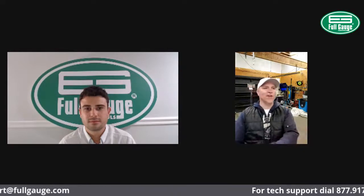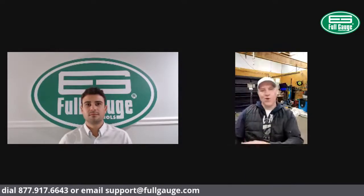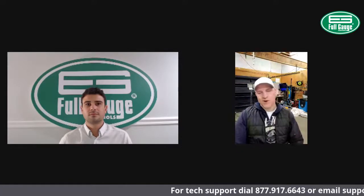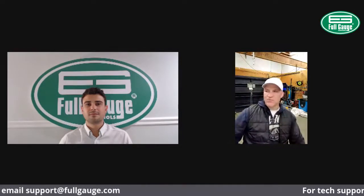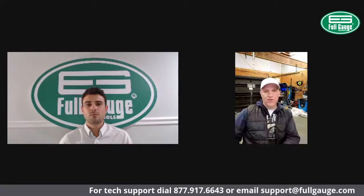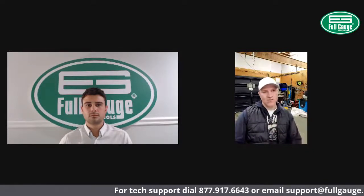The weirdest thing I think I've ever done with the Full Gauge controller is take one of those ventless heaters that use a pressure-based thermostat and switch it over to a Full Gauge just to get better control of the temperature. That, or an electric heater. I used a refrigeration controller to run a big industrial electric heater. I'm trying to think what else I've done that's off the wall. That's about it. But basically I'm using a refrigeration controller, and it gives you so much flexibility to run something that is not even related to what these controllers are targeted towards.